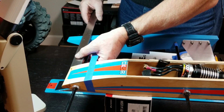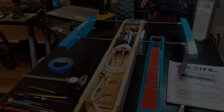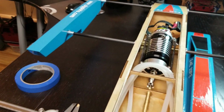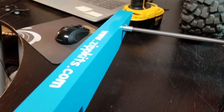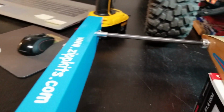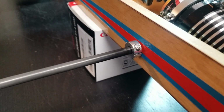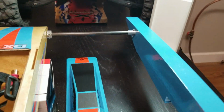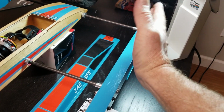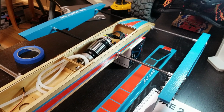Yes, we got our toe in. That was seated when it was drilled. Sponsons are now properly attached to the tub. Got all my stainless screws Loctited. Screws in the collars are Loctited in place. I have my toe-in on the right sponson, so that becomes part of the bench tune.